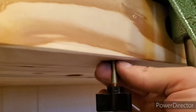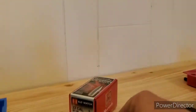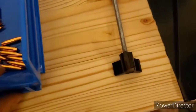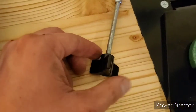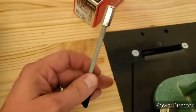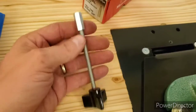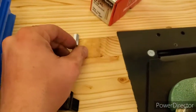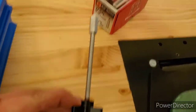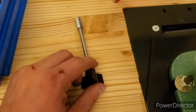I got these aftermarket — the original ones I made I'll throw a picture up, but they were just a little bit shorter. This is just a knob — it's a 1/4-20 thread, and I got a 1/4-20 threaded rod. It was a 6-inch section and I cut it down to about 3.5 inches. Then I threw a coupling nut on there and it works great, really cheap. The first one I welded the nut on, but I ended up using red Loctite and that worked really great.